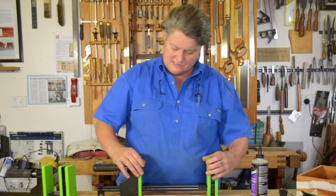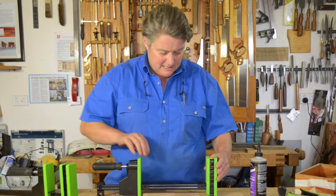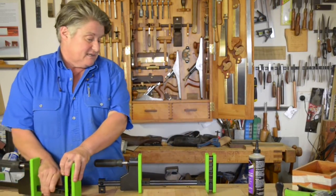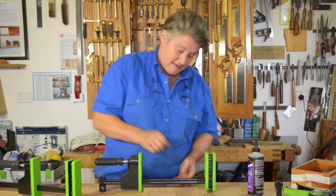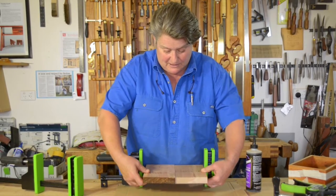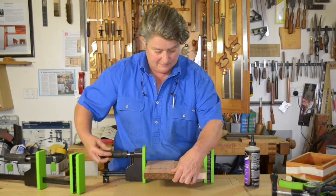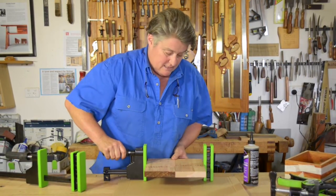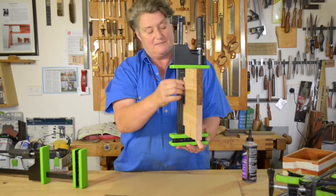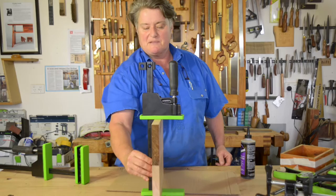They come with a soft closing jaw, which also stops you from marking your work. And they've also come with spacers. This becomes an advantage when I want to sit the work on two — you can see how easily I can take and place a spacer in. When I want the work to sit parallel with the clamp, simply tighten it up. The little spacer here is giving us an advantage: it's keeping the work off the bar and it's also keeping the bar clean.